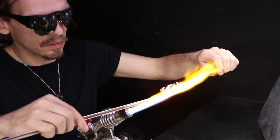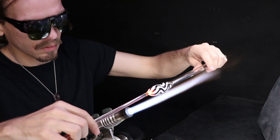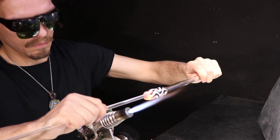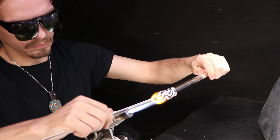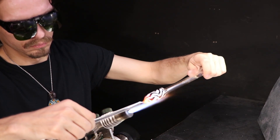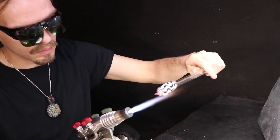When my concentrators shut off on me, I think I might have overloaded the circuit a little bit — I'll have to check the circuit breaker. That's one of the things you have to be careful about when you're running a lot of electronic devices: not to put too much on one circuit. The kiln itself is about 15 amps and then each concentrator does five amps, so you have to be careful to spread it out a little bit.